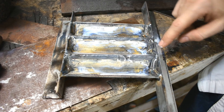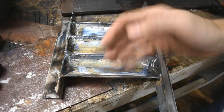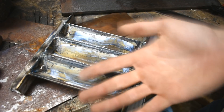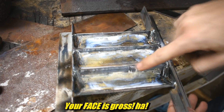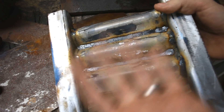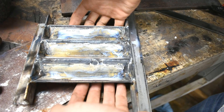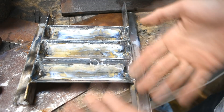I just cut it up into sections and welded it together - pretty standard, that's why I didn't make a video on it. One important thing: notice how this makes a V? That kind of acts like draft so the ingots fall out. I also cut these edges with kind of an angle so there's draft on that too, maybe 10 degrees. So the ingots just fell right out. I used a mix of TIG welding across here - I was practicing - and MIG welding under here when I decided I sucked too much at TIG. I made the base suspend it up just a little bit so there's space underneath, so there's no hot part touching the concrete when it's sitting on the ground.